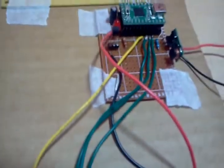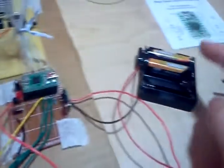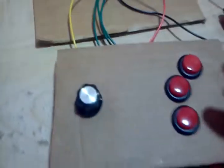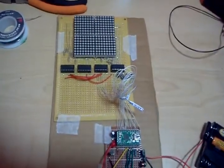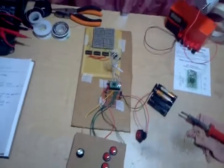Data out to the display board and then just some other little connections. We've got the boost regulator here to pop up the 3.5 volts from the batteries to 5 for the microcontroller. The wires just come out here to this little control pad that I've got rigged up for testing. I'm not sure if this is the actual layout I'm going to use for the controls when it's all said and done, but for the moment this gives me a platform that I can use to continue developing the software since it's all hooked up and I can actually test things.